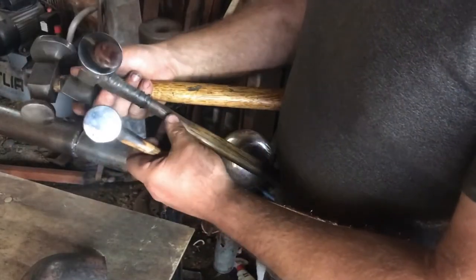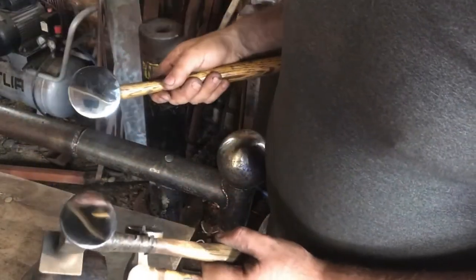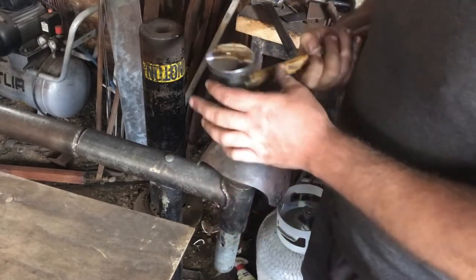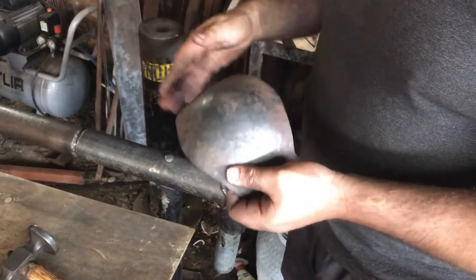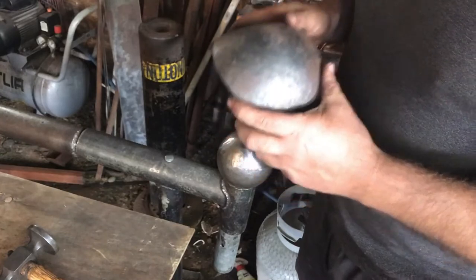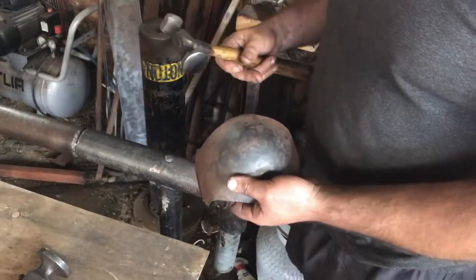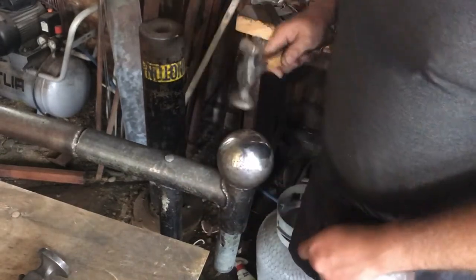You've got your all-terrain and then your heavy duty. What happens if you go really hard with a big hammer? That will just lift up the material and turn it back to a flat sheet, even though we're on a ball — and that's not what we want. But if you use a tiny hammer, you'll just end up spending forever. So it's a real trade-off.